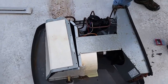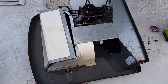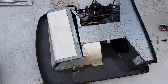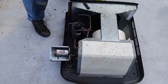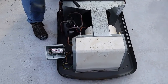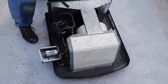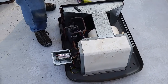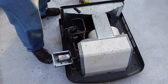Next will be the hard start kit I'm going to put on here as a modification. It helps the unit spin up quicker with lower inrush draw on startup. Now, a hard start kit is basically a capacitor with a way for it to switch in and out of the circuit when it needs to.